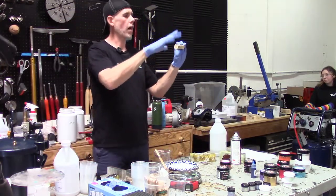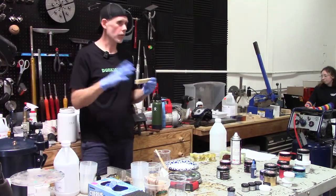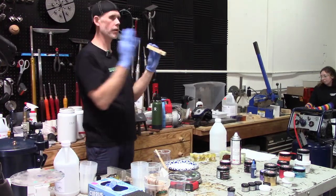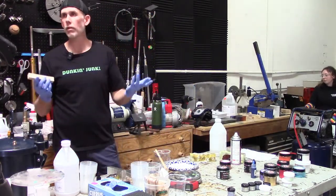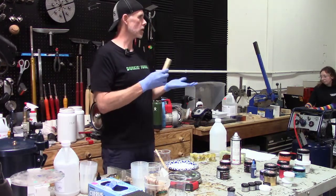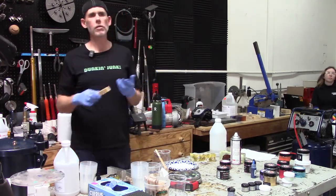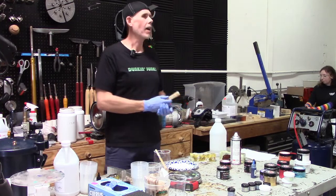Let's say you wanted to drop a block of wood in and it was at equilibrium moisture content, but you didn't want to dry it or you were in a hurry. You can just seal it off. Use something like five-minute epoxy and put a coating on it — maybe two. All you're trying to do is put a barrier between the casting resin you're going to pour around it and the moisture that's in it. Those are the three ways to handle moisture: dry it out, stabilize it, or seal it.